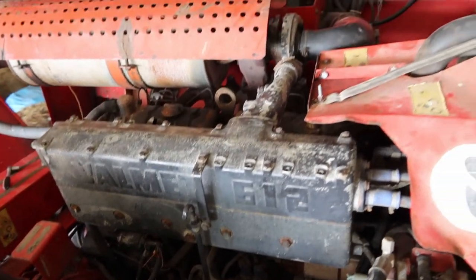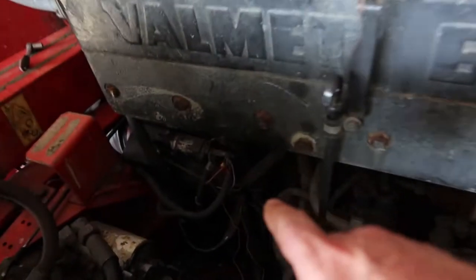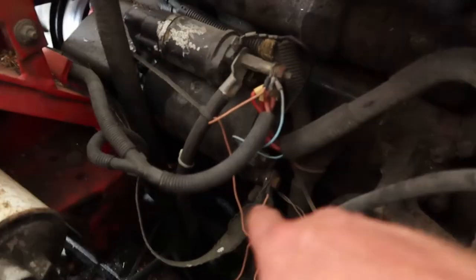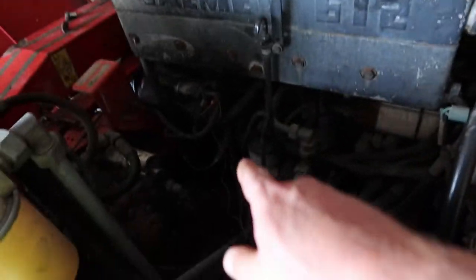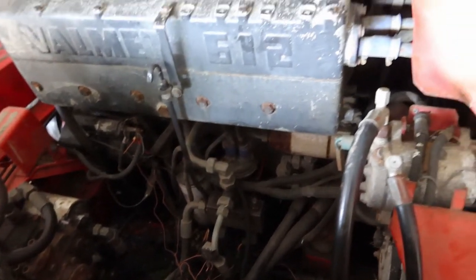So to overcome this, when I started, I just threw a battery up in the engine cover at the back, connected it in parallel, so I just connected down here onto this positive stud in the solenoid and onto that earth strap down there with a set of jump leads and with a second battery below, and she cranked enough to fire. But I'll also take a look at that, so we'll clean up those leads, see can we get it turning a little bit faster. Right, get started.